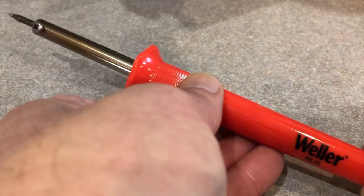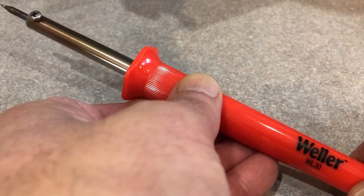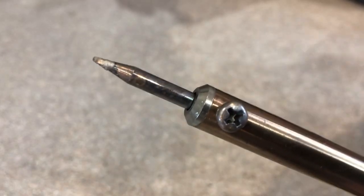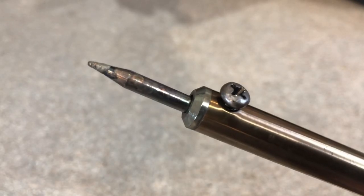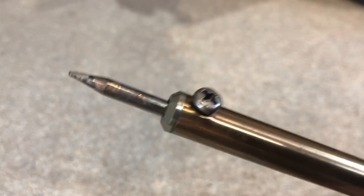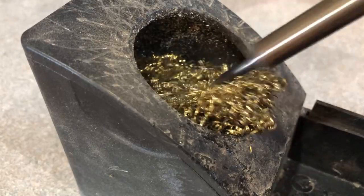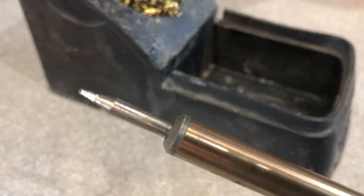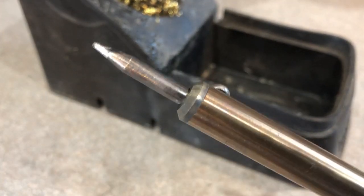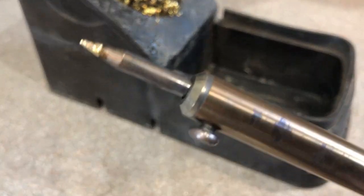For this project, I'm going to use a little Weller handheld 30-watt soldering iron. Nothing special — I think this costs about 15 bucks at the hardware store. The soldering iron is hot, and looking at the tip, you can see that it's not bright and shiny. That's because the little bit of solder that's on there is oxidized. So to make good solder joints and be able to solder easily, we first need to clean the tip and then tin it. I do that in one of these little brass wool things, and you can see it's already much more shiny. I got the oxidation layer off of the solder, and then we tin it a little bit with a little bit more solder. I've got some rosin core on there, and I'll shake it out to get the blob off the end so it's ready to go.